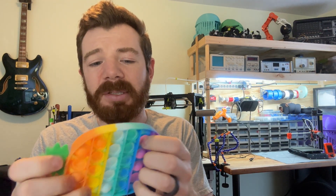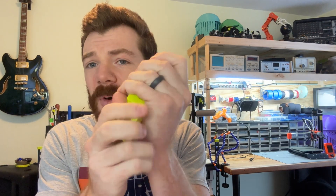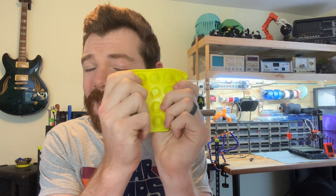The way they actually make Pop-Its is through a mold-making process, where they essentially pour hot rubber into a mold, which is how a lot of products are made. This allows them to make really thin, high-precision rubber. With 3D printing, we have a couple different types of printers — resin SLA or SLS, or FDM/FFF extrusion-type. A lot of these printers can 3D print flexible rubber, but there are some limitations.